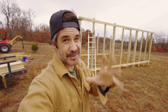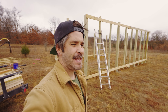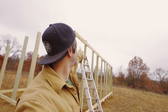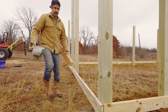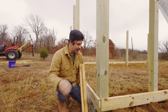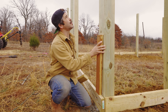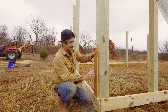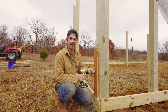I can't lie, I'm a little disappointed in some of y'all. I got a lot of feedback on the way I was doing things, and some of it was okay. But none of you experts told me this: instead of trying to put the top board on there and get it level, just make spacers. If the bottom is already level, just make spacers and work your way up with the boards rather than trying to do the top. I post these videos so all you experts out there could tell me what to do, and none of y'all told me to do this — I saw it on another video.